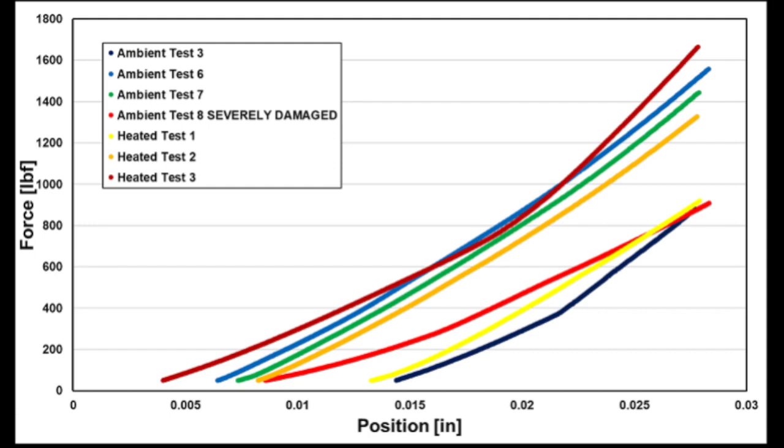We recommend using thermal blankets to heat the outer housing to 200 degrees Fahrenheit, at which point the bearing and adhesive bonded rubber can simply drop in without any resistance. This process addition should not incur major cost or labor additions to SKF's current system, and as the bearing housing cools down, it will simply contract and mechanically lock the bearing in place.